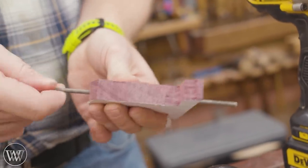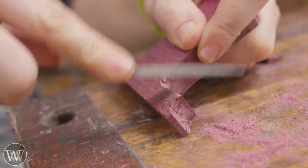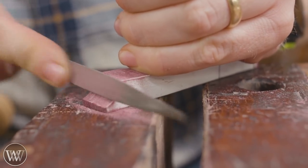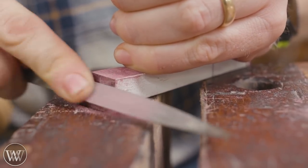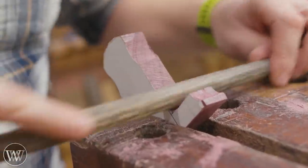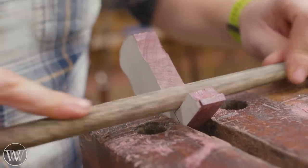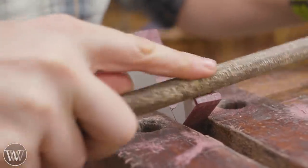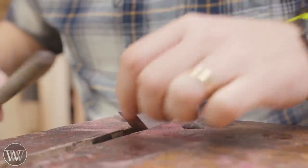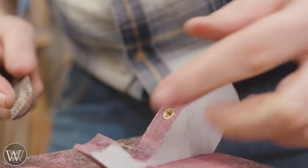To get the rod through, I'm actually going to file it out. I have a little rat tail file that went in there and cleaned out any burrs inside the hole, and that allowed the brass rod to slide in a little easier. Then I brought out a very fine file and got rid of all the saw marks and all the internal marks from the drills to smooth it all out and make it look pretty. I wanted to spend a lot more time on this and really detail the outside, but due to the time crunch I ended up not going quite as far as I wanted.